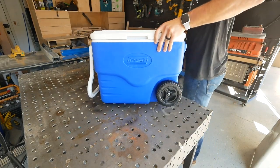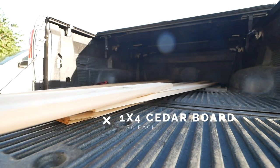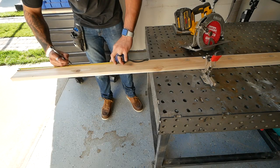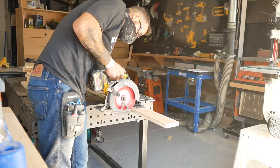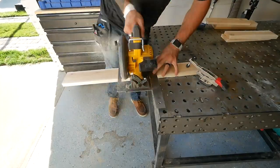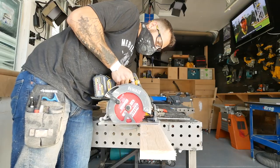For this cooler grill cart, I then went from there. For lumber I went with 1x4 boards that are 8 feet long in cedar. I went with cedar mostly because cedar has a tendency to age well and withstand outside natural elements, kind of like any kind of fence would, and last you a lot longer. Cedar can get a little pricey, but if you find a board that's damaged on one side but not the other, you can usually ask for a discount at checkout and they'll usually accommodate that for you.